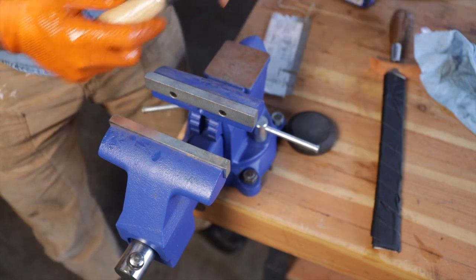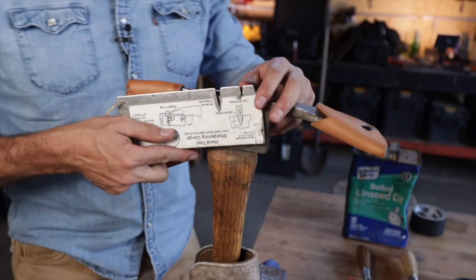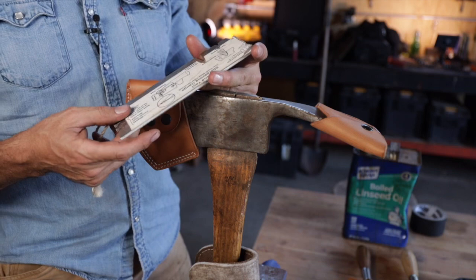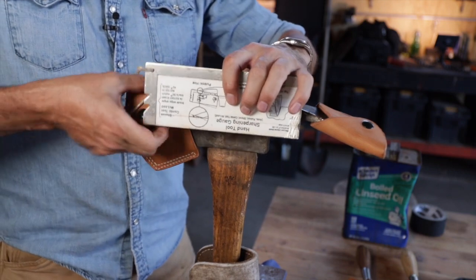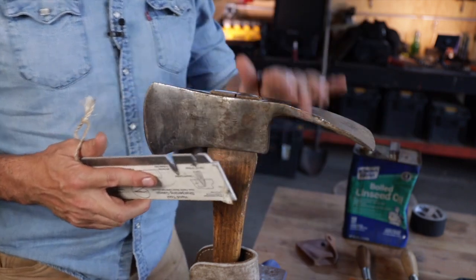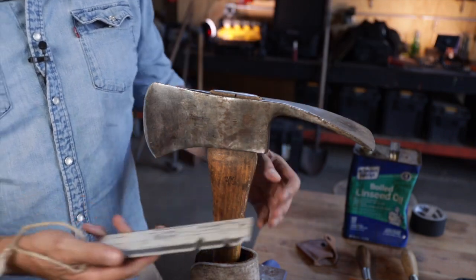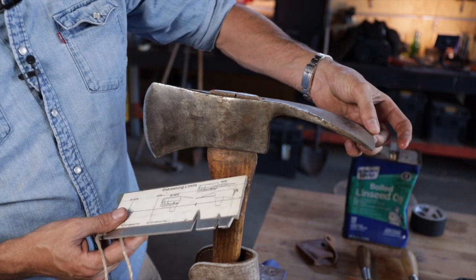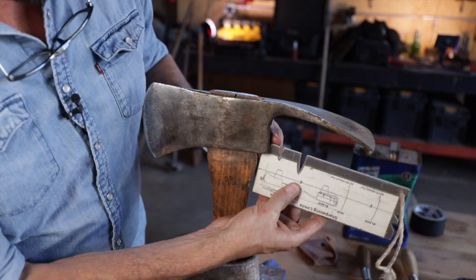Now we've got a tool that's ready for work. The final tool in the sharpening kit is a very clever gauge invented by the Forest Service years ago — a hand tool sharpening gauge. It's an amazing invention that works with all of the tools: McLeod, fire shovel, Pulaski. This is my FSS Pulaski after a season of abuse. In the next video we'll do a full restoration, which I do every year at end of season. What the gauge helps you do is determine what angle should be on the back of your grub hoe. It's designed for FSS-approved tools only, like Council Tool, for example.